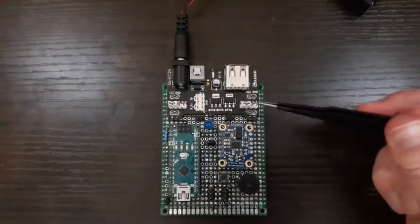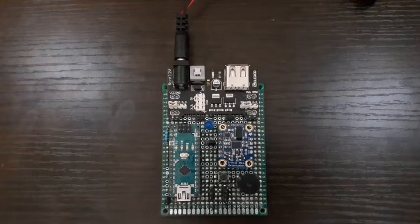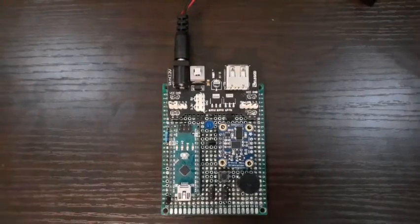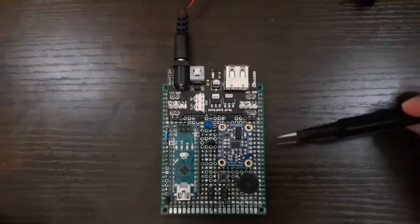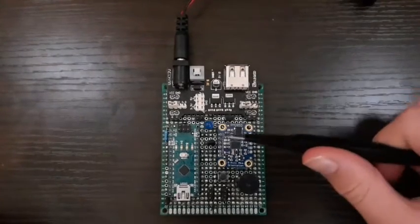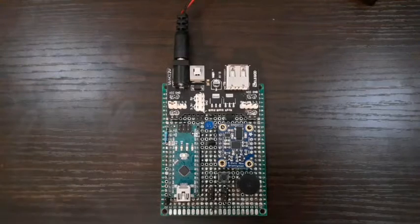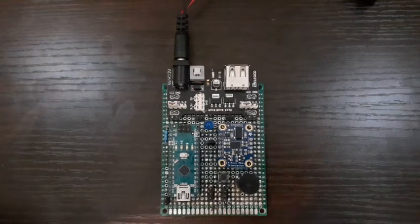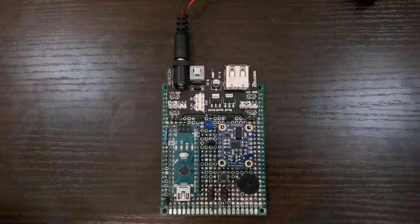I believe that's all the components in here. There are a lot more components I'd like to have on future builds — such as an SD card reader so I can obtain data, a barometer on board for pressure, and an accelerometer so I can detect acceleration. Those are things I'd like to have when I get a PCB version. This will probably only fly once or twice before I upgrade to a PCB, since this basically has everything I need just for thrust vector control. Once I get thrust vector control dialed in and functioning, I'll add in other components — but I'm a brand new programmer, so I thought just focus on what needs to be done first.